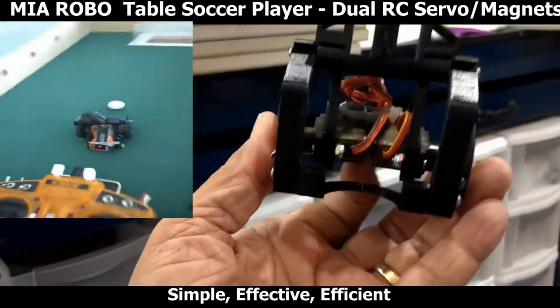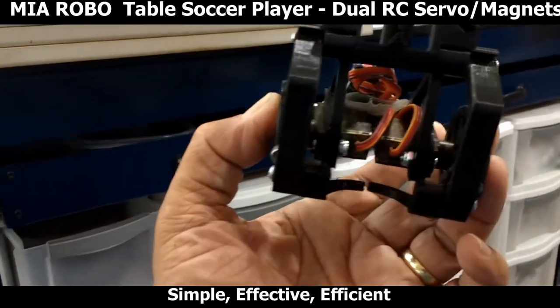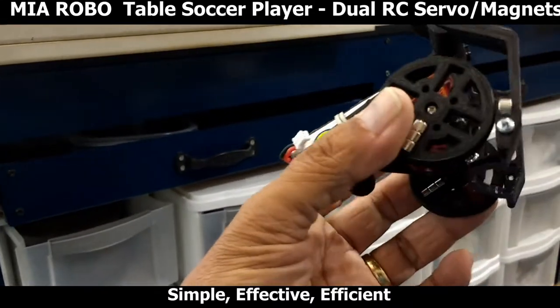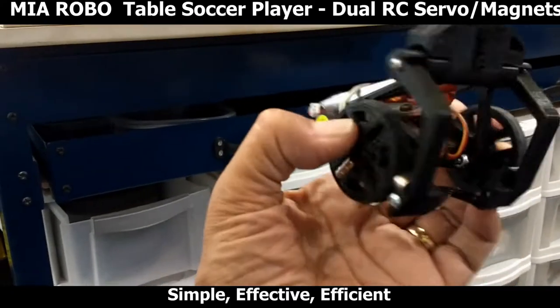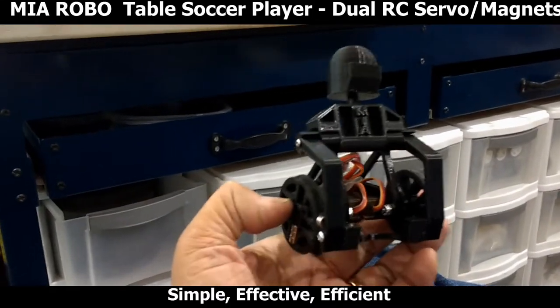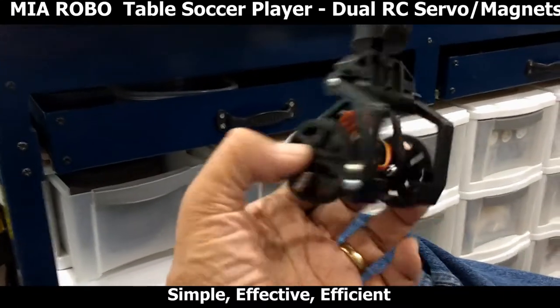The potentiometer inside each of the servos has been replaced with two resistors of equal value, totaling the full value of the potentiometer. And that is to obtain full left and right rotation on the servo wheel. I can go back, forward, left, and right using a transmitter that's been set to mix, Elevon mix.